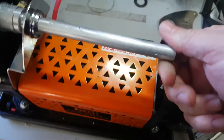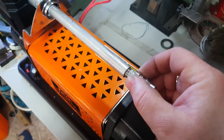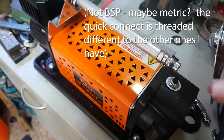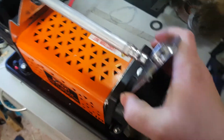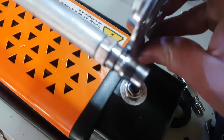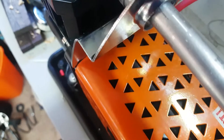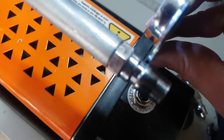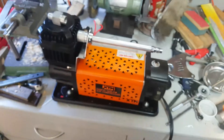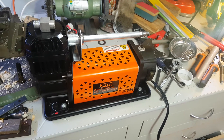The issue I'm going to have — and this is kind of where I'm at now — is this end. This just has a 1/4 inch BSP fitting, which screws in there. You can kind of see with that roughly lined up and that roughly lined up. Because I had to shorten that end 10mm to do the thread, I'm going to have to lengthen this 10mm somehow.